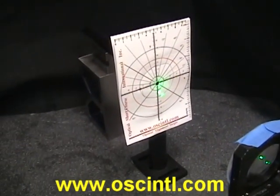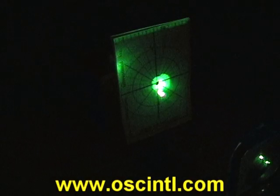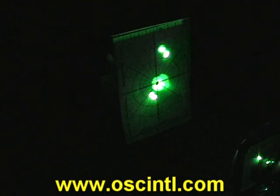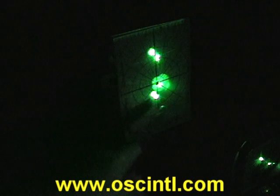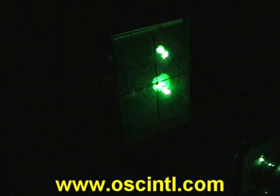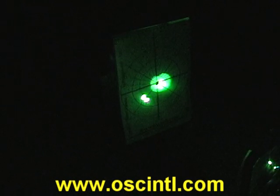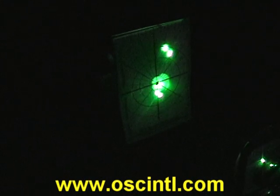I'm going to dim the lights a little bit. What we see are our various return spots. I'm moving the lens from side to side now — we see one return spot up here and a second return spot down here, and you can watch those move side to side in the x-axis. If I just twist the lens, doing a clockwise positive-y rotation, they both move off to the left; then a negative-y rotation and they both move to the other side.